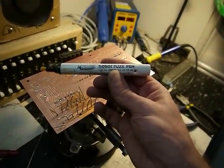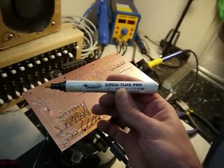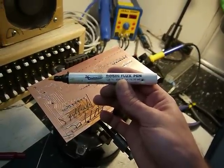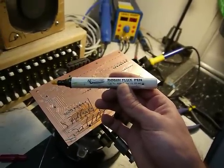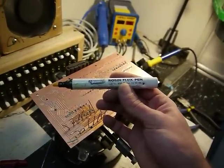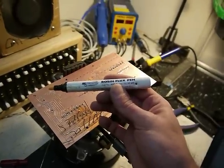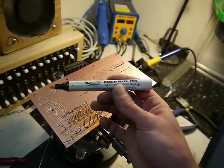So, if you solder — safety hazard that I'd certainly never heard of before. If you live at altitude and you're going to want to use a solder flux pen, then poke a hole in the bottom and relieve any pressure inside first, or else it might squirt you in the eye. And trust me, solder flux does not feel good in your eye.